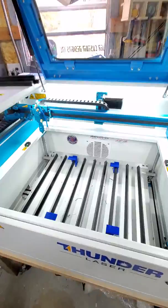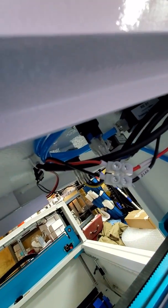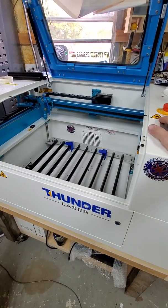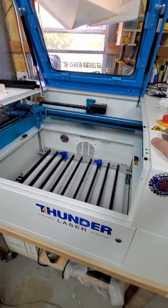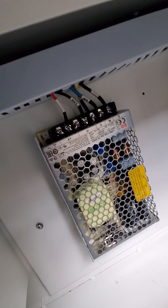So first let me go over how this is all set up. For the original lights that come on when the machine is turned on, I went ahead and just tapped into the power block there — the red and black. I also put a lead on the end to tie that back light into the side light. The problem was, tying into any of that stuff, the machine would glitch because it overloaded the power supply and would interrupt and cause a glitch in the system.